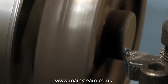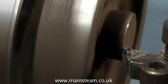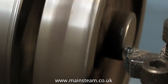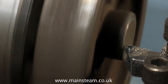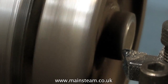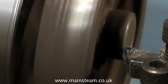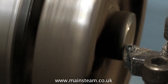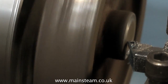If you watched the previous video in this series all about machining a casting, I gave a more detailed view as to what I'm doing — I'm not going to bother doing it twice. So now I've turned the flywheel around in the chuck so it's now held by the newly machined part, and I'm attempting to machine the boss at the other side, which is equally hard. But I'll get through it. I'm taking very light cuts because the flywheel is not held by much in the chuck, so it's going to take a while.